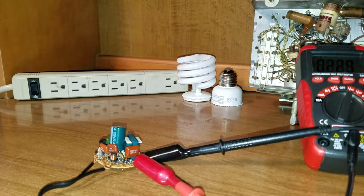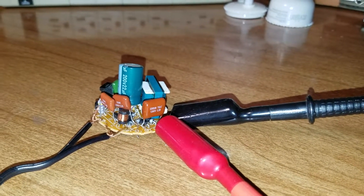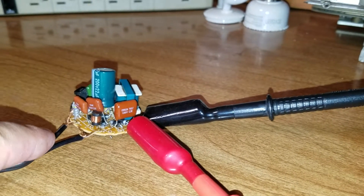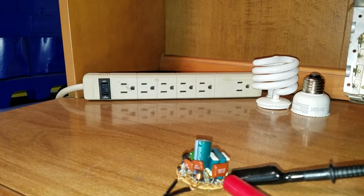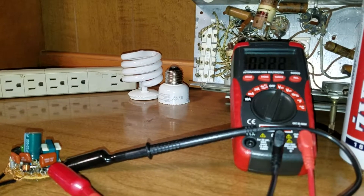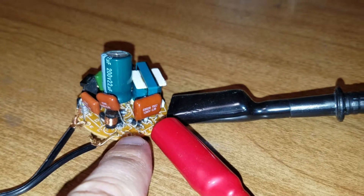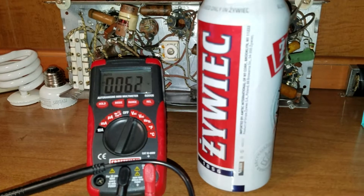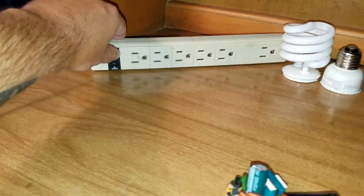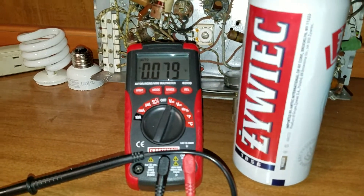We have here the compact fluorescent bulb circuit I was playing with for a few episodes. I've hooked up the 115-volt input to a cord that I'll be putting into a power strip. There are the other parts of the fluorescent bulb — I've got one filament output here, and the other one tied to my digital multimeter. It's not plugged in yet. I plan on leaving this power strip in the off position, plugging it in, and I think I want to see 250 volts output on one of these filaments based on what I'm reading online.